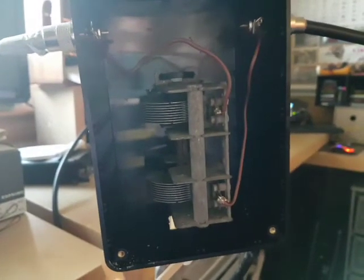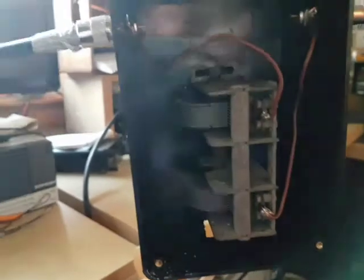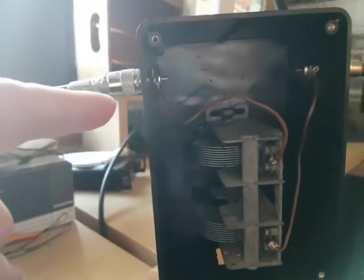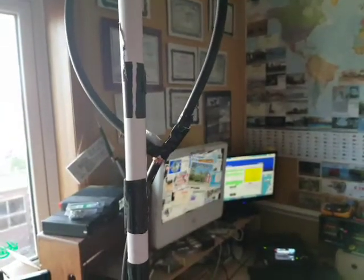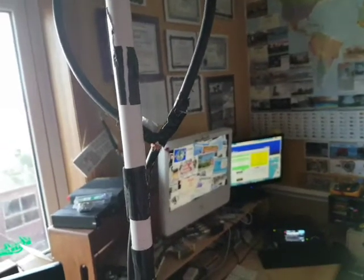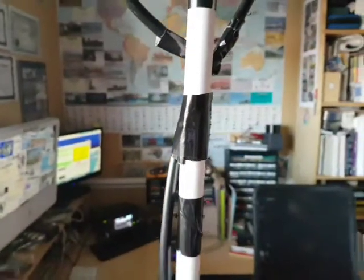I was having difficulty getting the whole thing working, so I went for something simple. It goes up to the shielded sections of the RG213, which is the bigger loop. The small loop — the shield and the core are joined at each end, and then come off the feed in the usual way.